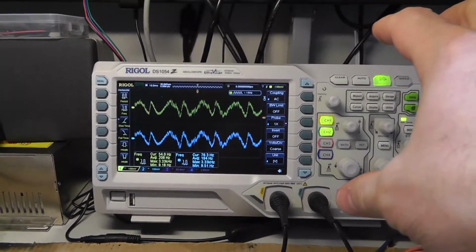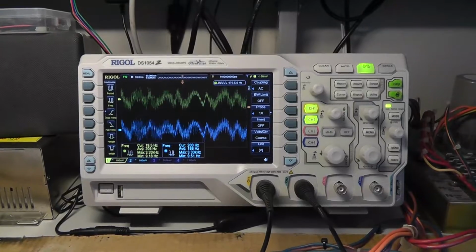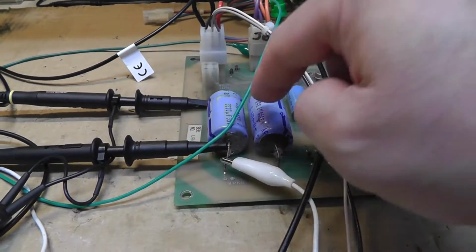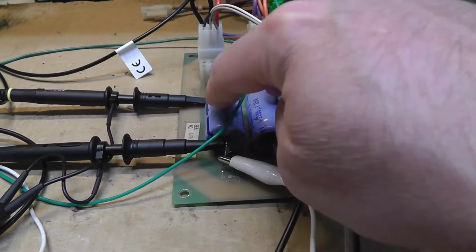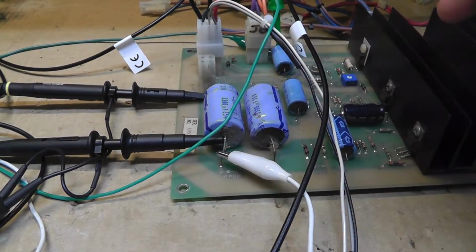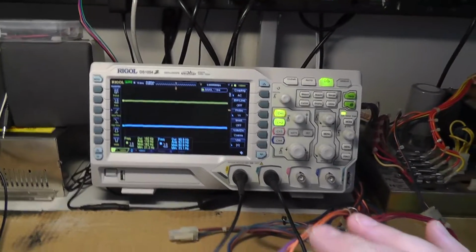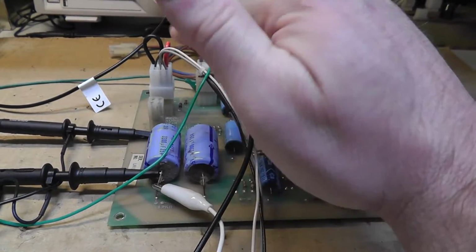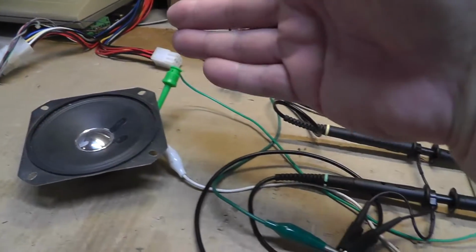Since I started this video, I actually posted a thread on Clav where more knowledgeable people could weigh in and tell me what these capacitors are actually doing. Mark from Hudson Arcade, Mark Spaeth, mentioned that yes, these are high-pass filters, but their primary purpose is to block DC voltage from going to the speaker. Then I did some research on that, and it's unlikely that enough DC voltage or current would go through. Current, I think, is the bigger issue for the speaker, honestly.